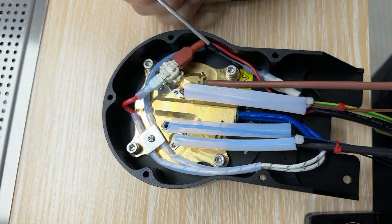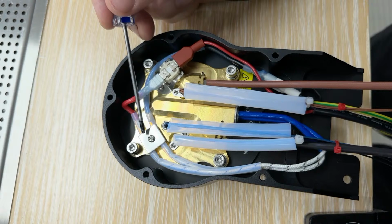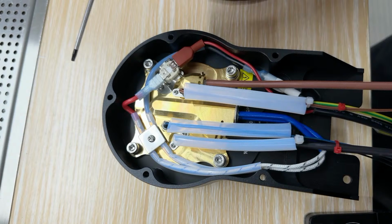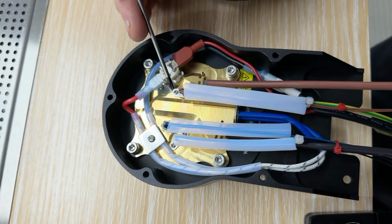In practice, I don't think these have ever failed. These are made by a German company, because I was convinced early on by the salesperson to buy the very most expensive thermal fuses. I had heard that if you go cheap on these, they can fail, and then the safety is actually what takes your machine down, which would be kind of tragic. This as well is made by the German company and clipped on. This is set for a lower temperature than this. So sometimes a thermostat might go off. For example, if you had a temperature sensor that for some reason failed, then the thermostat would kick in and cut power. That's happened a few times, not too often, but sensors can fail.